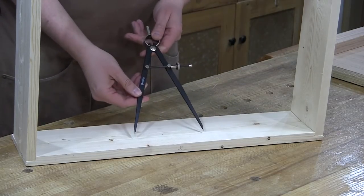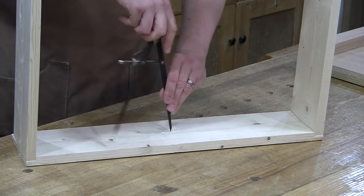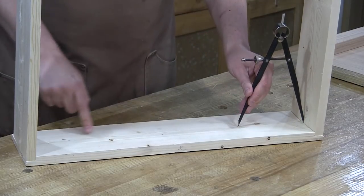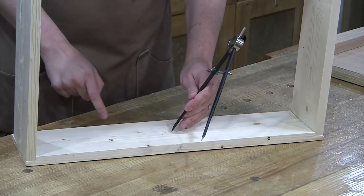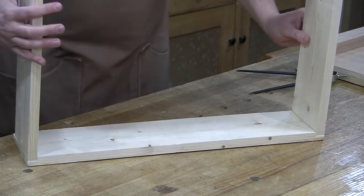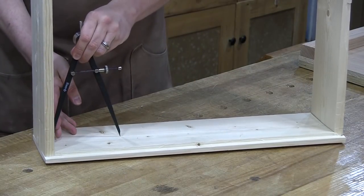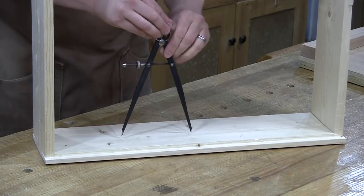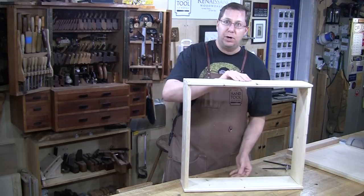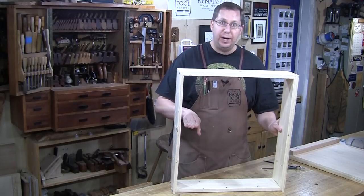The dividers don't have to divide the case in two steps — we can divide it into four steps. So doing one, two, three, four, the second mark is the halfway point. Most importantly, I can flip the case over, start again at the bottom, and do one, two. Now I've precisely located the divot on both sides of the case, so the shelf will end up square.